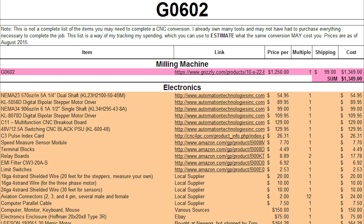I would also say if there's a larger NEMA 23 available, like a 600 or 700 oz-in, go ahead and get it — the bigger the better, it's not going to hurt you in any way. All of the big components came from AutomationTechnologiesInc.com. The 570 was the biggest NEMA 23 they had when I bought mine; they may have something larger now.